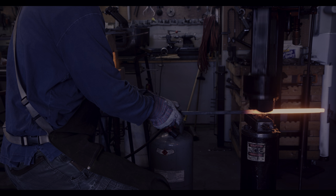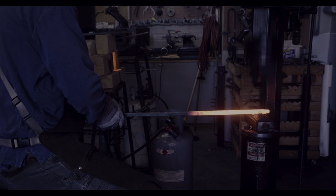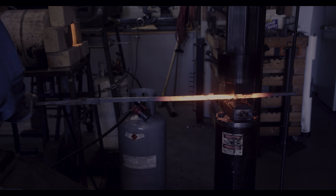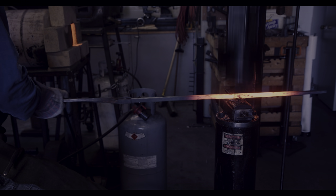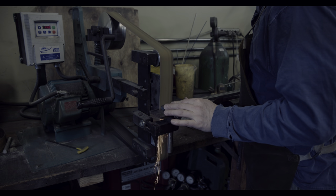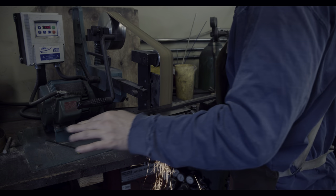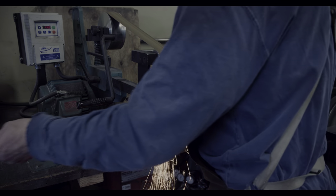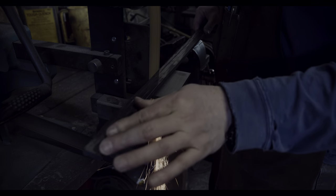Since I had to start over with everything again, I have already twisted my pattern welded bars and forge welded them to a mild steel bar that will form the back of the sword. This core billet is what I am cleaning up on the belt sander now. The cutting edge and this core billet need to have squared up sides to ensure successful welding. To help with that, I verified that my tool rest and platen are at a 90 degree angle.